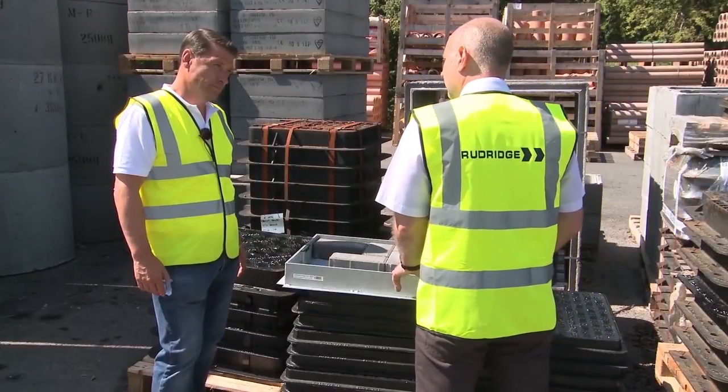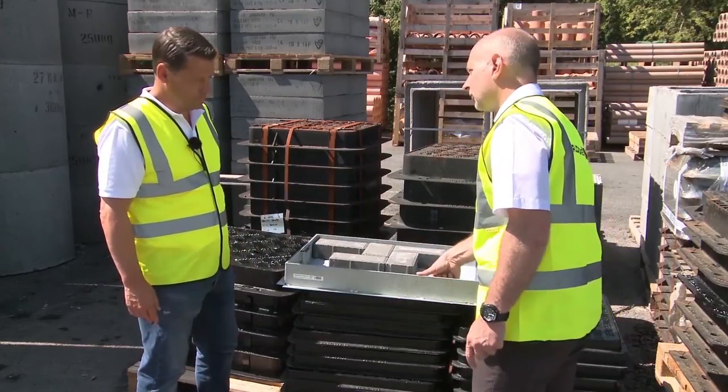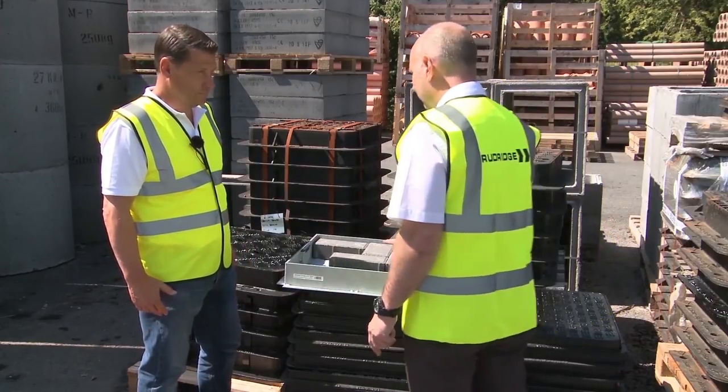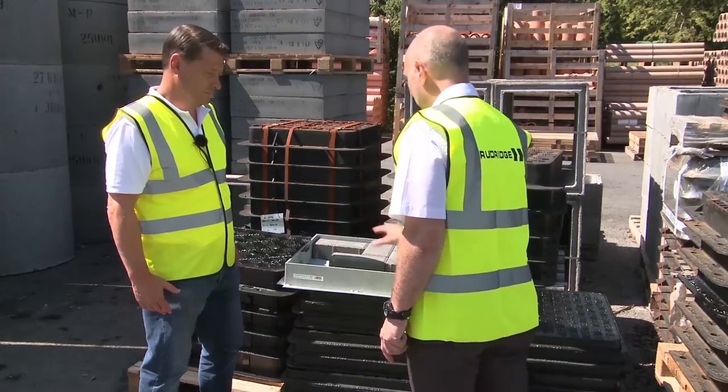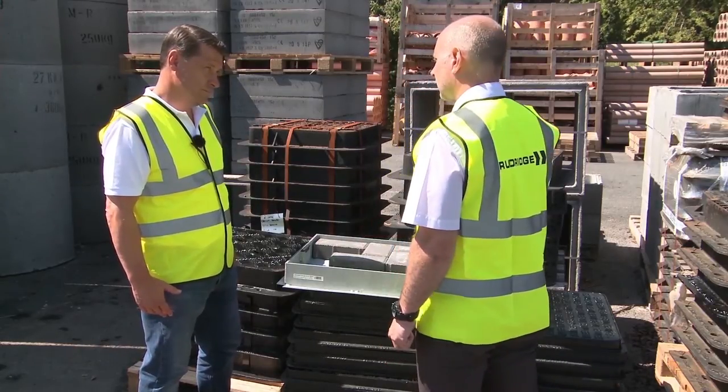This cover is 600 by 450, has an 80mm frame depth and a 73mm recess. This is designed for 15mm of sand and then your up-to-60mm block paver. It can be used for 50mm blocks as well.